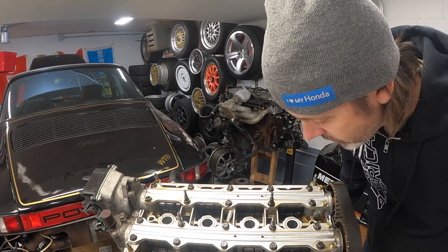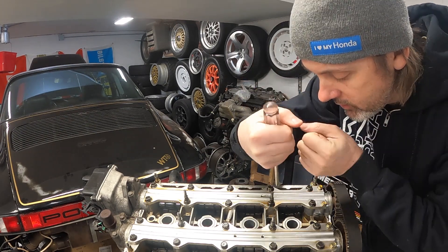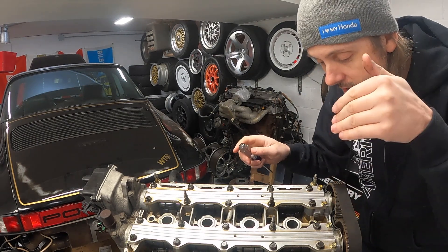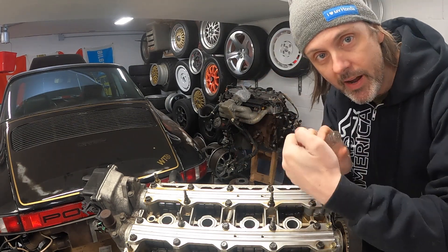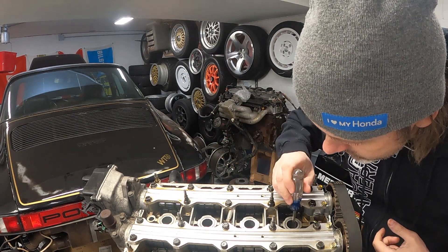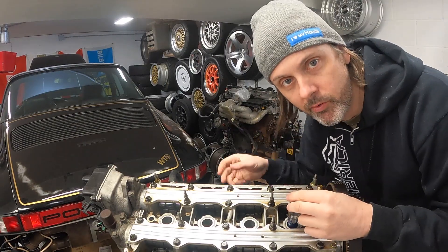I don't know if this is going to work, but somehow I need to get that thing out of there. I can't really fit needle nose pliers in there and twist it. What I saw somewhere on the internet is someone used a bayonet - they smashed it into that soft brass and then twisted it out. I don't have a bayonet, so we're going to try doing the same thing with a number two Phillips screwdriver.